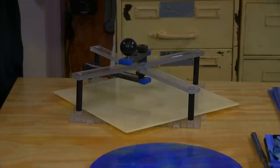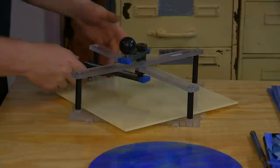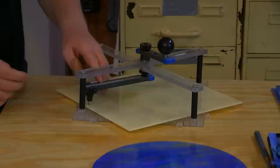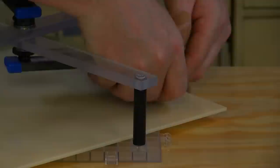My molds are limited to just over 12 and a quarter inches to allow that little extra bit. So I have to make sure I don't set the cutter all the way out because the fused disc will actually be a little too large. I'll set this up and double-check it to make sure it's in the right spot.